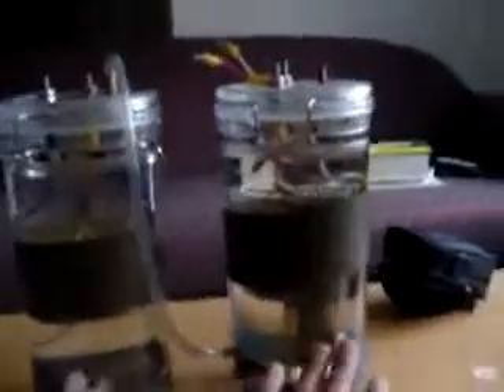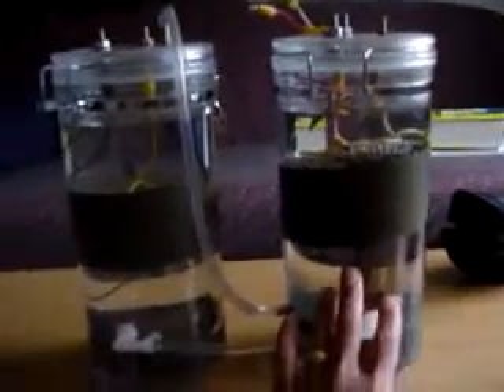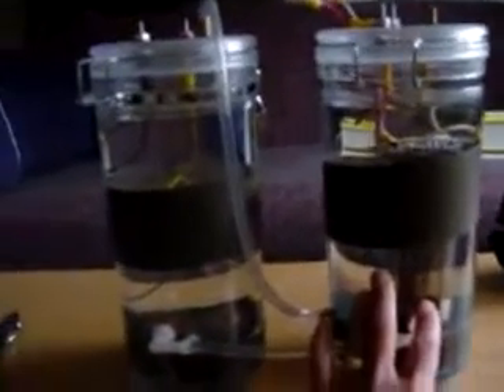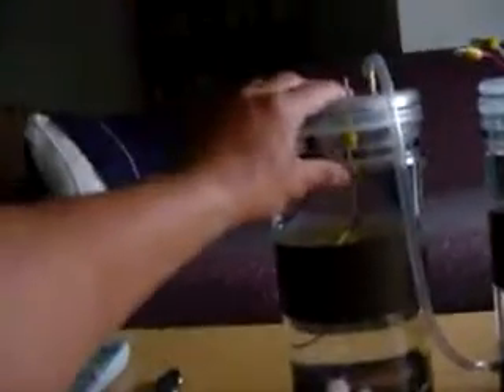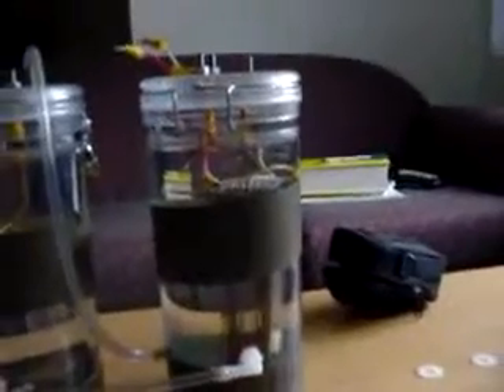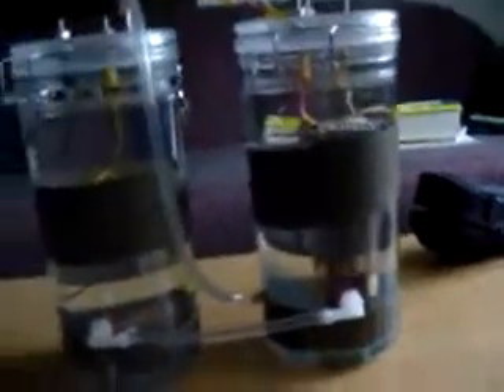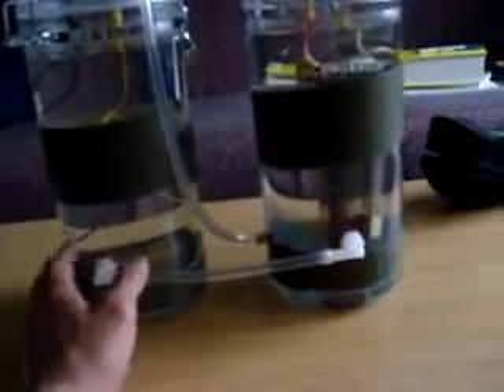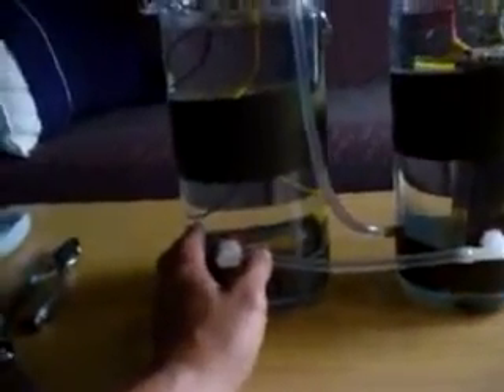I have a theory since I'm going to be putting a lot more amperage — this one is going to be requiring a lot more amperage because of the bigger plates. So I figured the water in here is probably going to heat up. My theory is to use the hydrogen build-up from this one to pass through this tube, and the gas flows through there. On the top, this one goes to my bubbler and takes the hydrogen and oxygen gas from there. The bridge here — I'm hoping that the cooling of the gas flowing through the water will help cool this side and at the same time try to transfer some cooling back to the other side, which I don't think is going to be producing too much. But it's all theory right now.